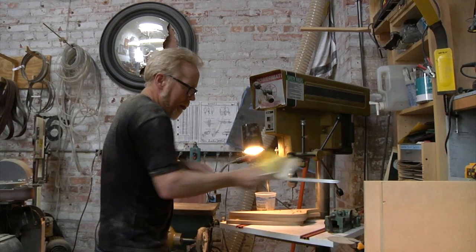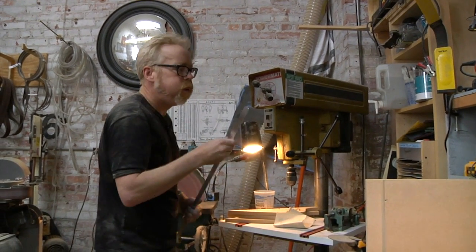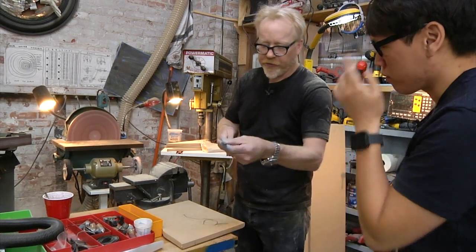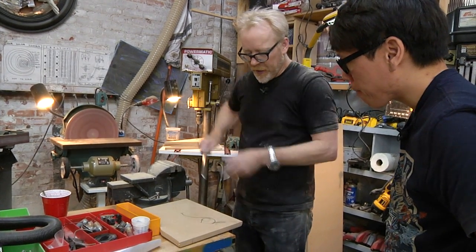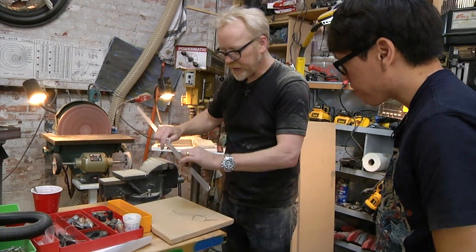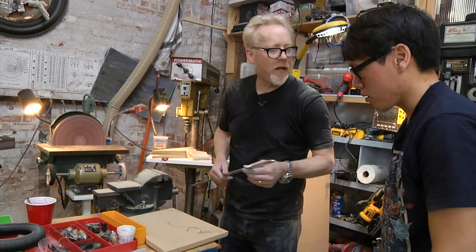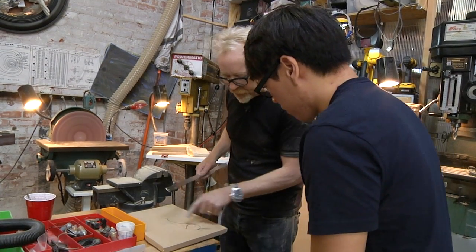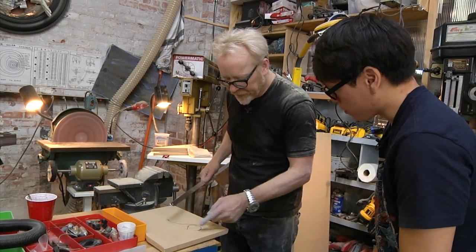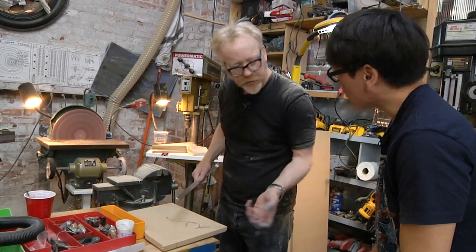Adam, what's your process going to be for creating this object? Well, I've just used sandpaper to take off the anodized coating on this hardware store aluminum. I'm going to bend it into the shape of the trigger guard, and then I'm going to polish it to a high polish because I think that's what the hardware should look like. Then I'll drill a second mounting hole for putting this in, and then I'll drill this little trigger guard front